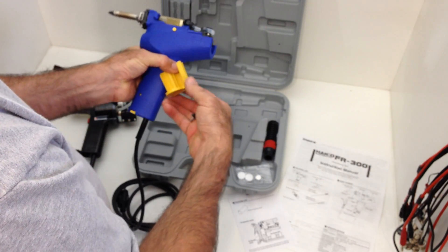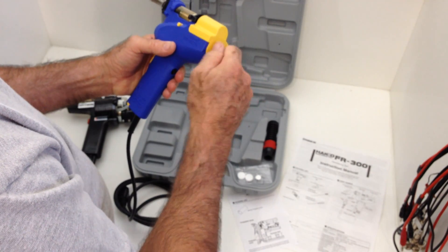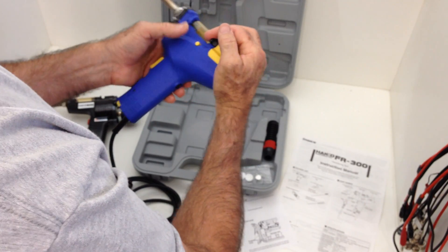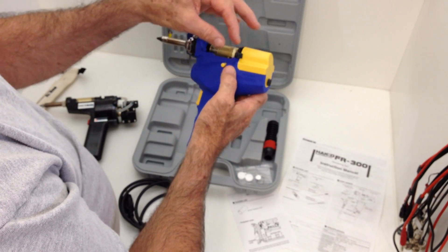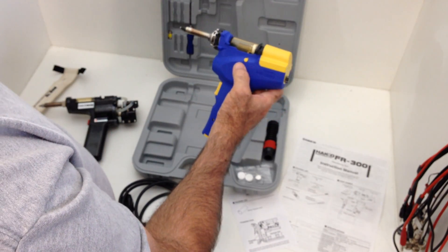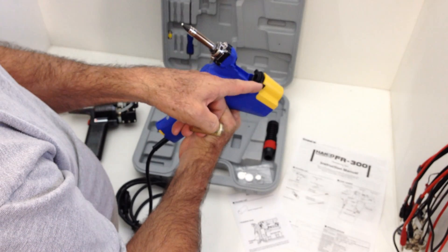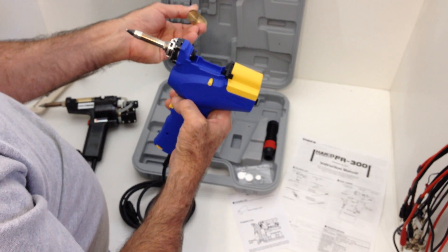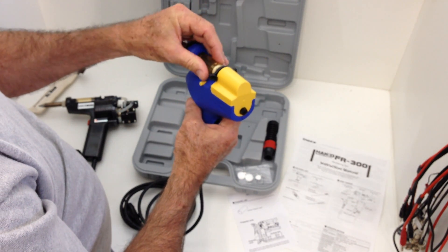Something I wish they might have done is put a little retaining washer on the inside so the screw wouldn't get lost. If you had that on there it would start to push the cover off, although it pulls off really easy when you loosen it up. The mechanism for the desolder tube — for removing and cleaning the solder out — is much nicer than the 808. I like that. Another nice improvement: instead of having the filter back behind the cartridge in the diaphragm pump area, it's right in here. I like this idea better — you're going to be able to see whether or not the filter is getting dirty. Much better design — they really put some thought into that.